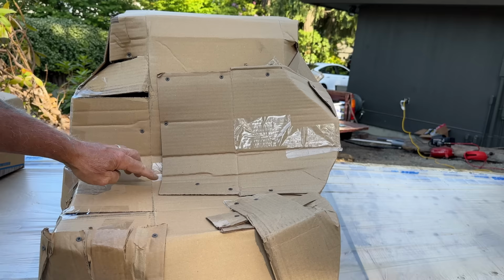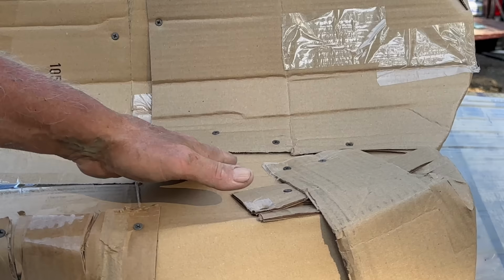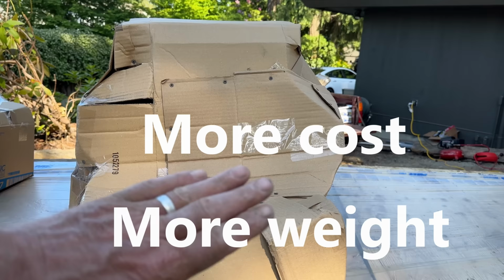This is okay. But like here, you can see this. And we do use the tape. The tape is more designed for this rock right here, this area. There's an elevation change between these two, and when you put a piece of tape, there's no way mud can get underneath there. And with the tape, you create a skin, an outer garment that is continuous without elevation change. Things like this are going to eat up more mud. We don't need mud in there. We just need a 3/4 inch layer of mud over the top.